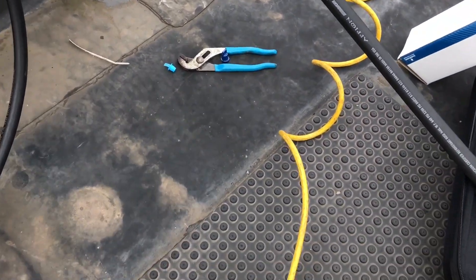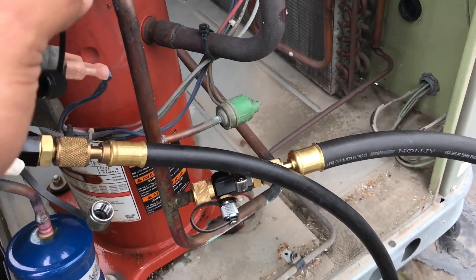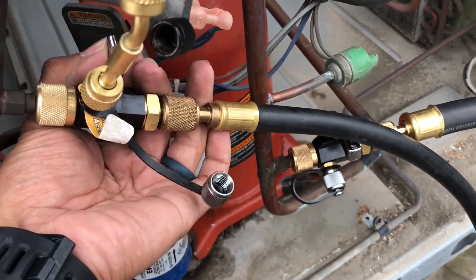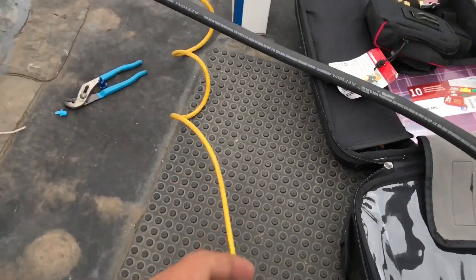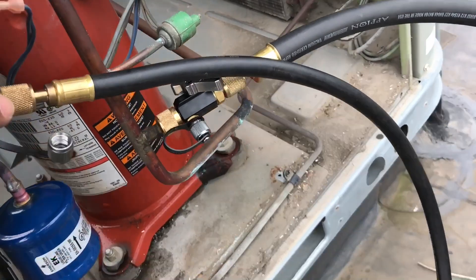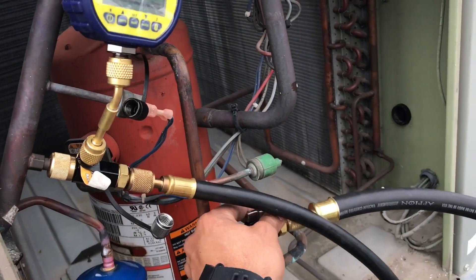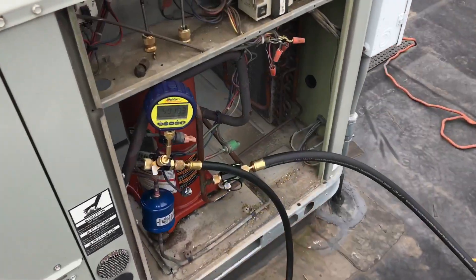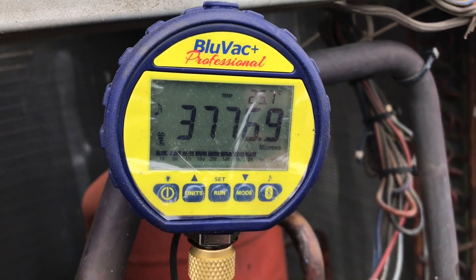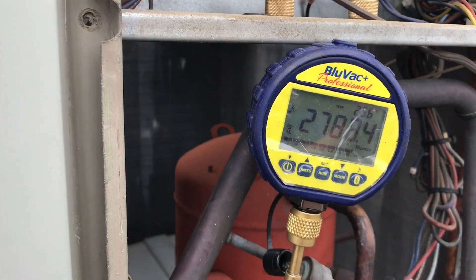Let's turn it on. I'm going to open everything, make sure everything is pretty tight, and it has some nylog. I like to crack them a little. I'll usually open and close them a few times because there's air that's trapped underneath the ball valve. Let's just give her the full open. It's been about two minutes — you can actually hear the Schrader seal pull down when it's pulling into a vacuum.